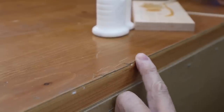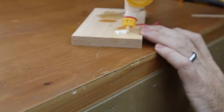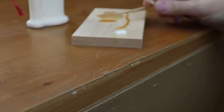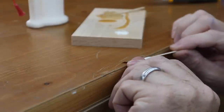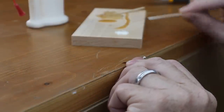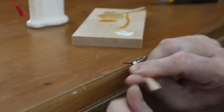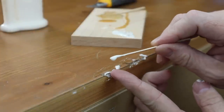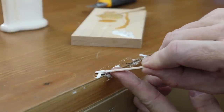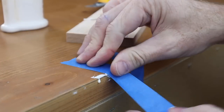This is the back edge of the top. There's some veneer that's split, so I'm just going to try forcing some glue in. I can get that in there. Get the toothpick in, shove some glue in there. I figure if this doesn't work I can always paint it. Use some tape to clamp that down.